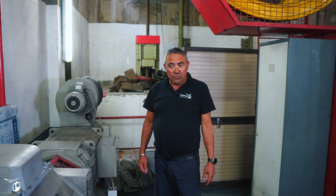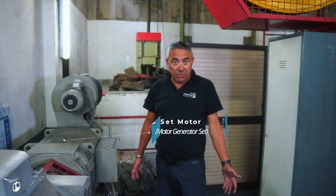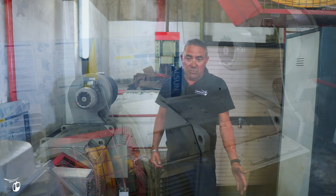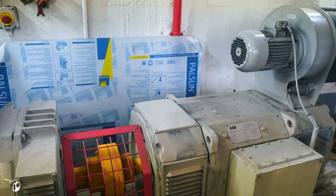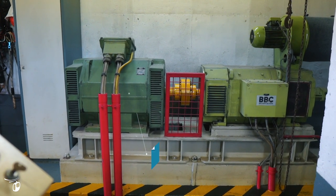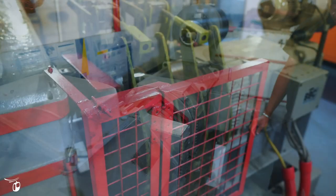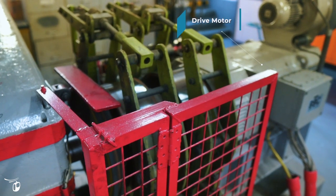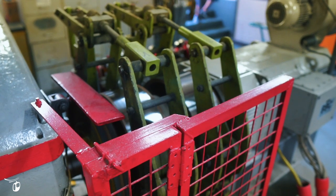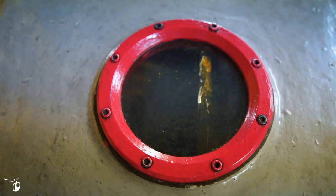We're here at the bottom station plant room and the first thing I'm going to show you is the MG sets, the motor generator sets. We've got two of them and we switch them over every six months in order to have some maintenance done to them and give them a rest. Basically, what this does is change the AC electricity to DC electricity through the generator. This is the generating part and that then feeds the drive motor over there. The drive motor turns the gearbox — this is the original gearbox — which in turn drives the bull wheel, which drives the cable car up and down.